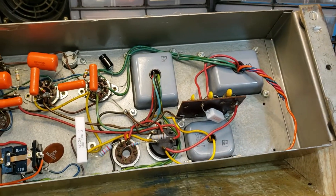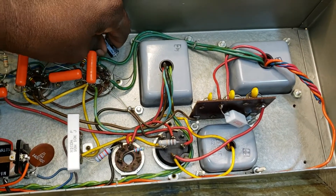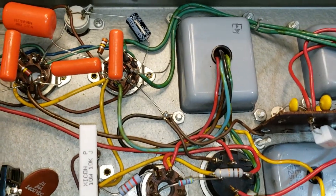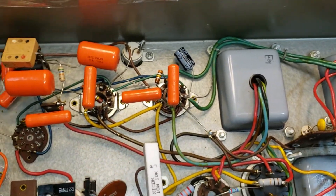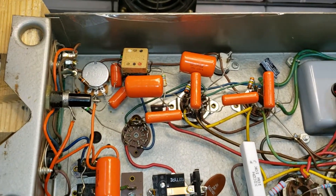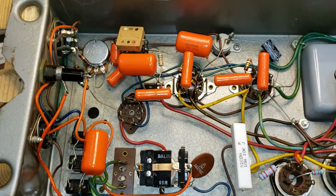Now I'm getting ready to take this amp outside. Let's see what you got in here — okay, you got a 200, 220, 220 microfarad. Okay, cathode bypass capacitor — that's fine, that's all right. I've got a drawer full of some 1,000s, but the one that's in there is fine.